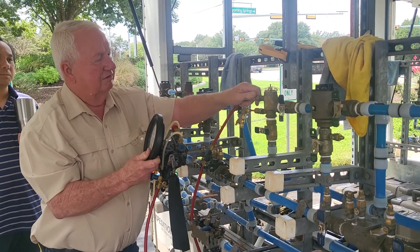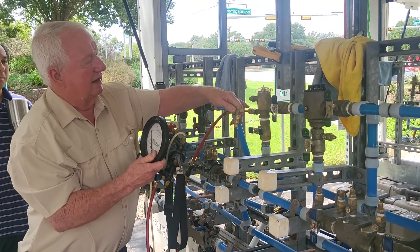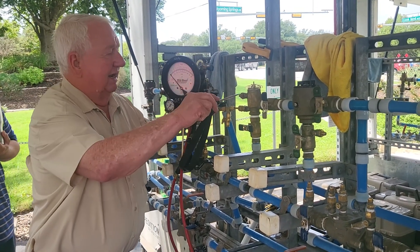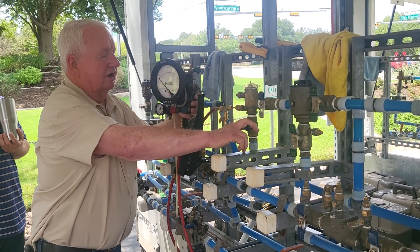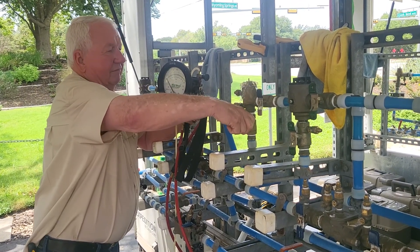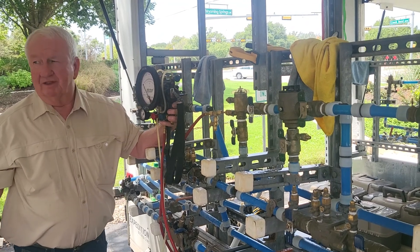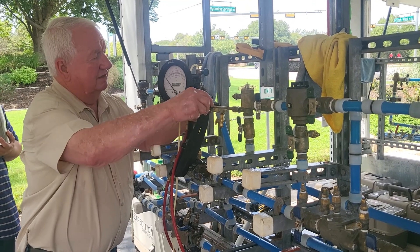So I take this off and drain the water out. I can hook my hose here while I'm doing that. I'm going to wash off the inside of that and see if that check valve went all the way down — and it did. So I'm going to close this. I'm going to open shutoff valve number one. If I open that nice and slow, I can open it the rest of the way — it's still going to pour water.